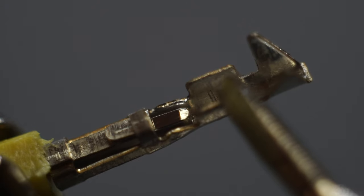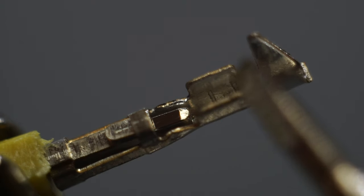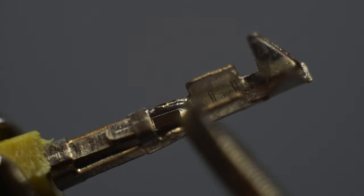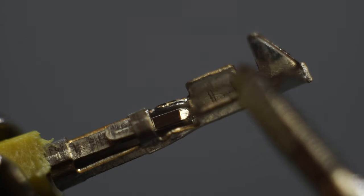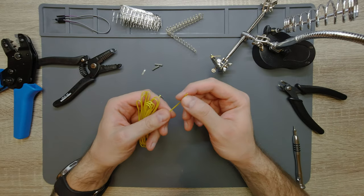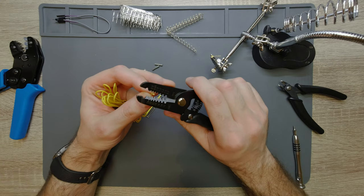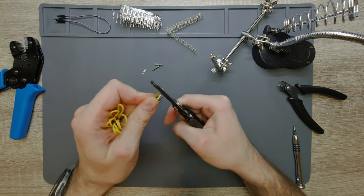This strip length should be around two millimeters. When we strip back the cable we have to make sure it's not really longer than 2 to 2.5 millimeters. It's also a good idea to keep the jumper pin inside while crimping so you can notice if the cable is stripped too long and still cut it back. You can eyeball this two millimeters — either you get a feeling for it after a while, or you use a marker to draw a line.